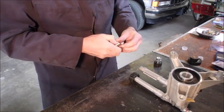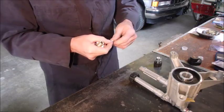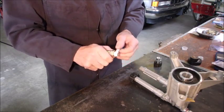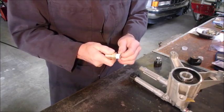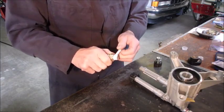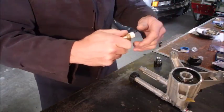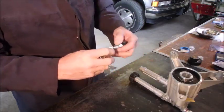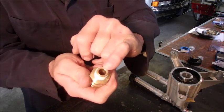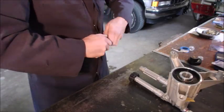Like I said in the other video, my pal and I are partners in a really expensive one, but it's spending some time over at his house. When you roll these, you roll the thread sealer or Teflon tape in the direction of the thread, and you make sure there's no interruptions at the hole.